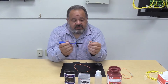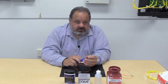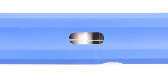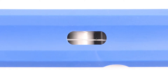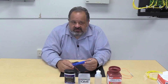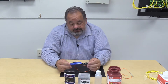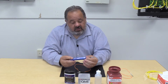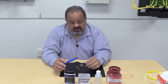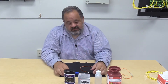If we look at the one-click straight on in the barrel, there's a very small cleaning tape inside. You can see the spool that releases the material. This can do about 525 clicks before it's used up — we're talking about five or six cents a click, very affordable and very popular. If we need to extend it for longer reach, we can, for panels. The nice part is it spins and cleans at the same time, and literally as its name suggests, one click and we've cleaned the end face.